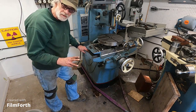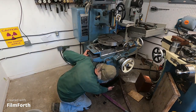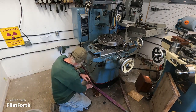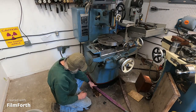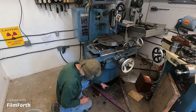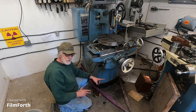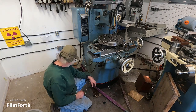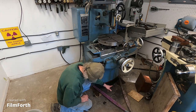I have it shimmed up to get it level. The two back spots have a cavity with a bolt hole, but this is not a locating point. When the machine's in place it'll have just that single front point and the two back points, and it's easier to get the machine perfectly level — as perfect as you can — with the master precision level. I pried it up and got the plate here; I had a wedge.